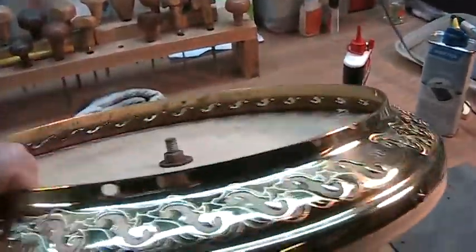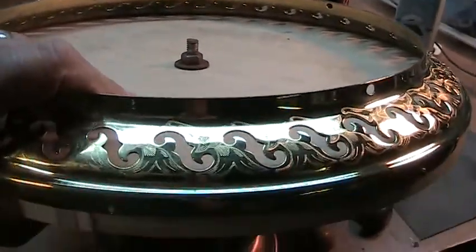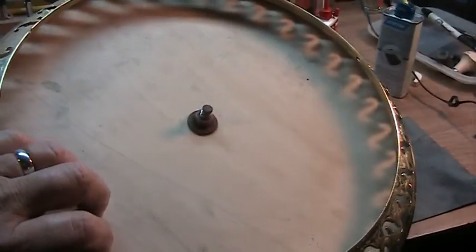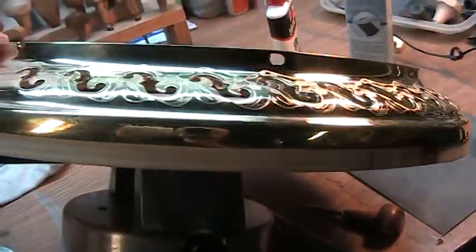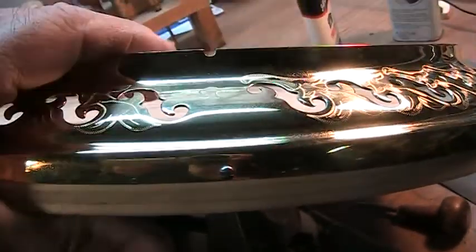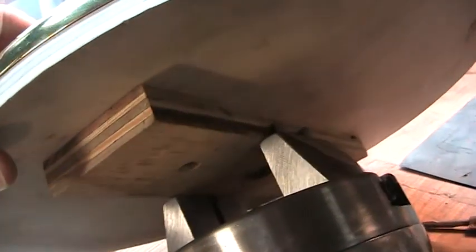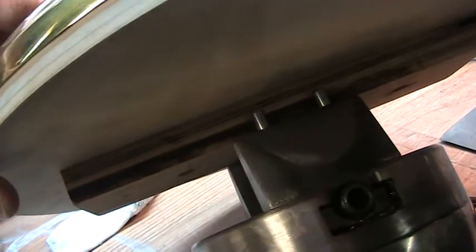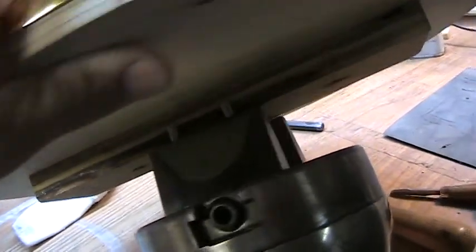This is a B&D flange, probably late 20s. I've built this jig that I'm using to hold it. I've made it so that it fits onto this wooden disc, and I have a few screws in it just to hold it in place. What's helping me here is this engraver's vise — on the bottom I connected this little piece of wood so that I could clamp it into my engraver's vise with these pins on both sides.